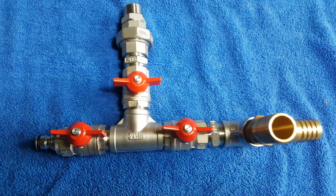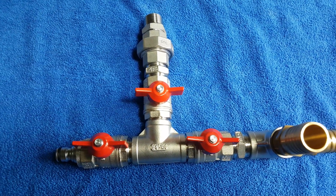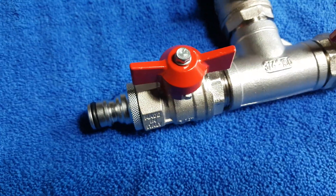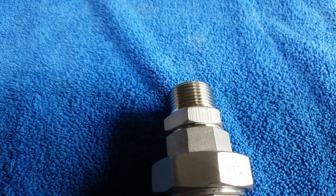This one that's in use at the moment — these are available in half inch, three quarters and one inch, with stainless steel fittings. These taps you'll see are butterfly valves. We've got three in place. So if you can imagine that this side here is your water tank, this itself is a three quarter.